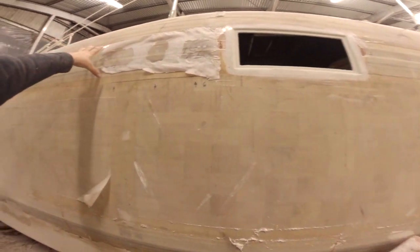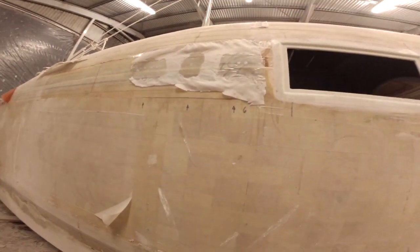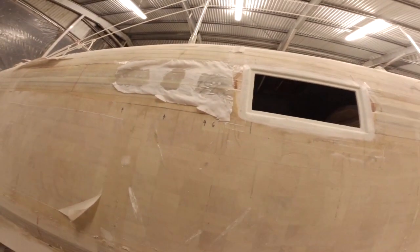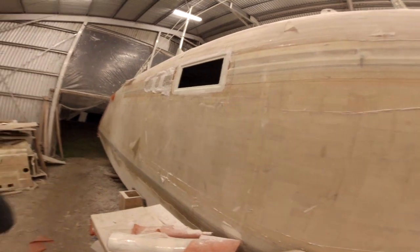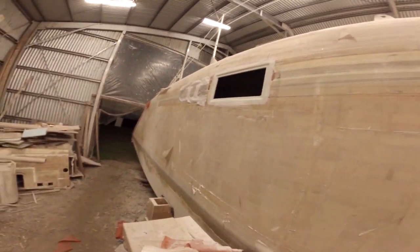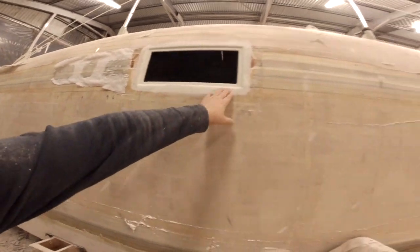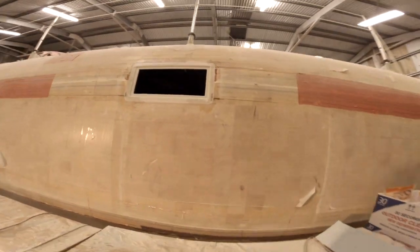And there's a bunch of holes here that I drilled out and backfilled and filled and repaired with some repair weave on top. So some light weave on top, just to make sure it all keeps together nicely. Maybe overkill, but I don't like having holes I don't need in my boat. And these should be very strong. And I've backfilled also all the mounting holes I needed to put in to get all of this straight and flat. And yeah, it's been a good day.